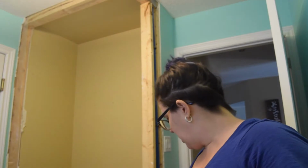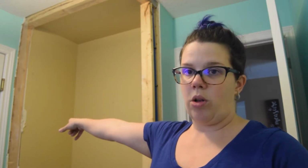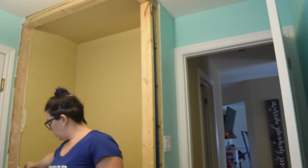And then before we can install any of the drywall, I have to sweep everything out, because obviously you want it to be flat to the floor. And then we've decided that instead of replacing four floor tiles over here on the ground, once the drywall's in and the MDF faceplate and the trim, it seems really silly to replace four tiles when only two of them will have spots like this big, not huge. So we're just going to replace the two that will have big gaps in them, and have a small piece to fit in front, and then the same thing on that wall over there, because I have to replace this drywall, and there's a little square at the bottom that needs to be done as well. So those two pieces will just be little squares. So it's going to be two big tiles and then two little chunks, I guess. But I need to replace my battery and then I'm going to measure this stuff.